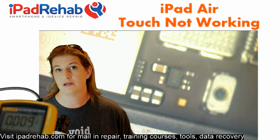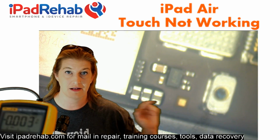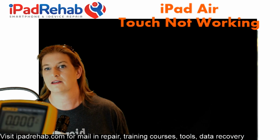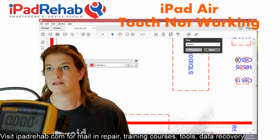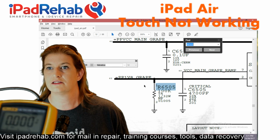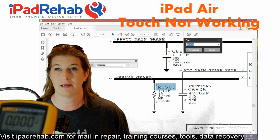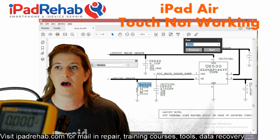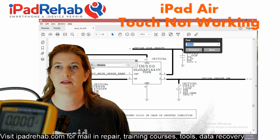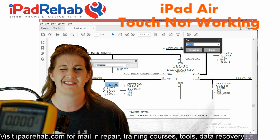That should be telling that chip, hey, the user wants to open his iPad, so you need to shoot out your power voltage, the 1V8 power voltage. So let's go see if we can figure out what that means. So let's go back. We are missing the R6505 voltage. We should have had ground on one side, and on the other side of that resistor we should have had PP1V8 grape, and we were missing it. So why are we missing PP1V8 grape SW? Because this chip is not told to shoot it out. So we can't replace that chip, or point a finger at him. He's never told to do his job.